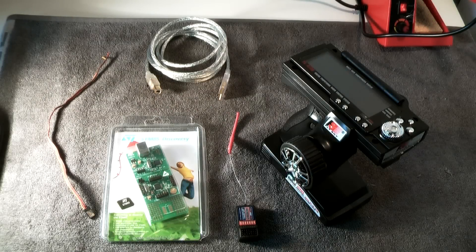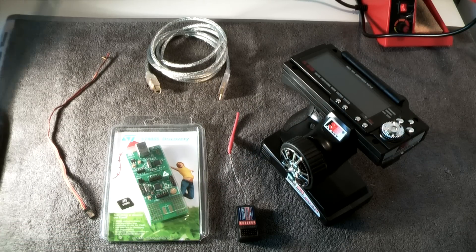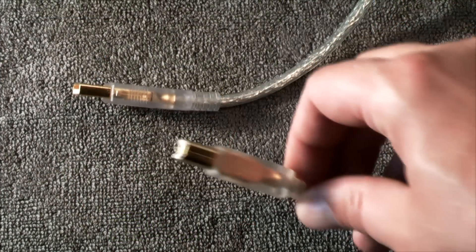These are the things you will need. In the description box below you will find all the needed links. First, of course, a GT3B from FlySky, a six-channel receiver from HobbyKing, a STM8S discovery board, some old servo wire, and a USB cable with a Type B plug on one side like shown here.